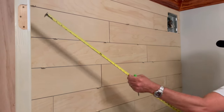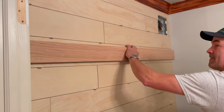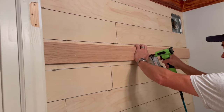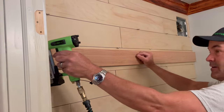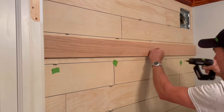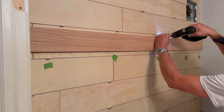Now that the wall is covered from crown molding to baseboard, it's time to move on to the hanging rail. I get a measurement from left to right — I'm using a three-quarter-inch solid oak board and I want to put this directly into the studs because it's going to have hanging hooks for towels and needs to be super strong. I use my pin nailer first to hold it while I tap it left and right to find level, then I go into the studs with headless trim screws — two per stud location — and that's going to be super strong for hanging any amount of weight.